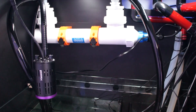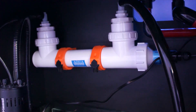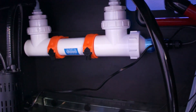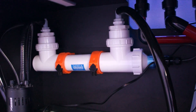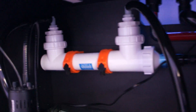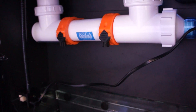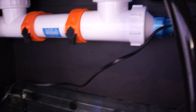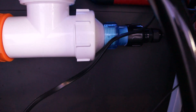That's how she's looking at the moment. Normally you want to run just the pump or return through the sterilizer for a day or so to make sure there are no leaks. Then once you're feeling confident, you can turn on the bulb. But I'm going to plug in the bulb now just to make sure we've got a good connection and power to that bulb. And you should see a little glow come out right here. I don't know if the camera picked that up, but it is glowing now.